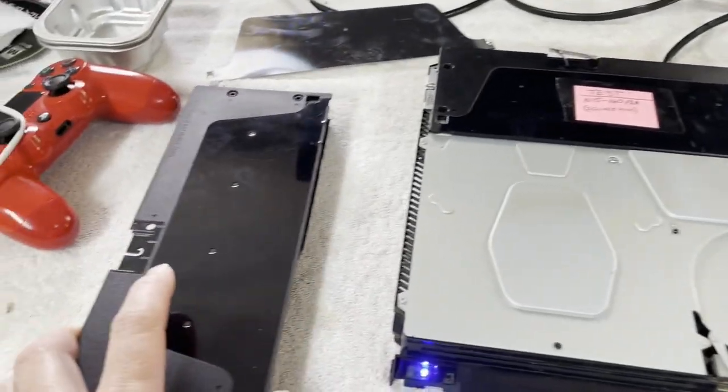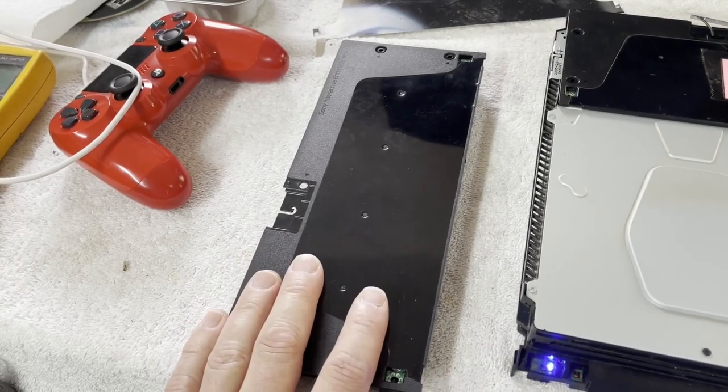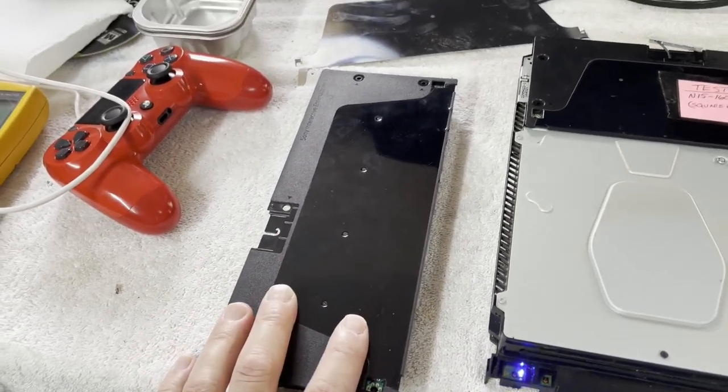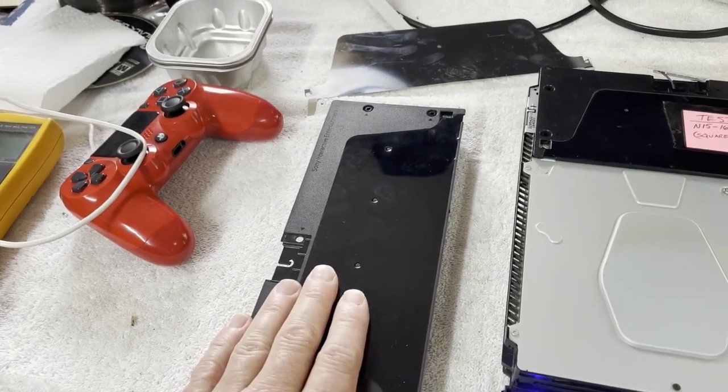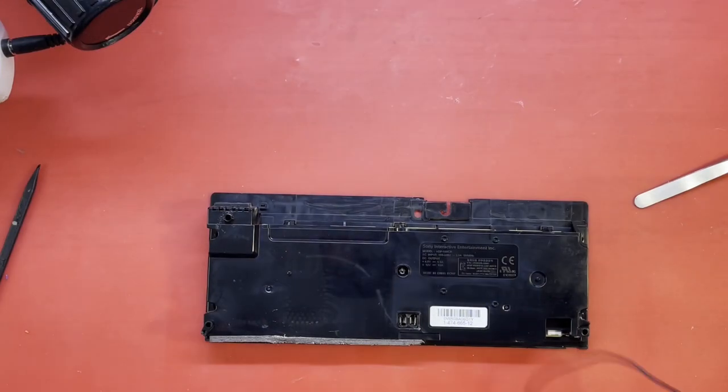Let's get the supply inside of the workbench because it looks like it's got a five volts standby, but when it comes time for the 12 volts to come up, it does not. So let's see if we can get that going. We are inside of the workbench, let's see if we can figure out what's wrong with this power supply.